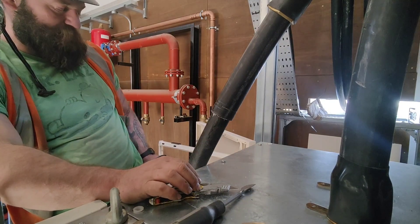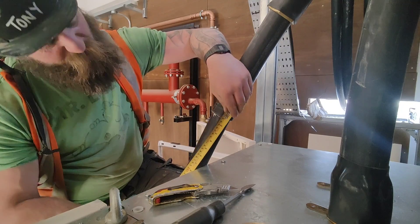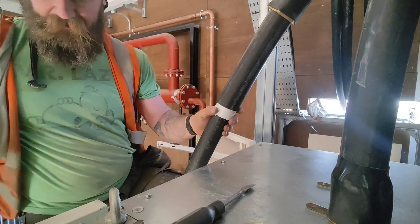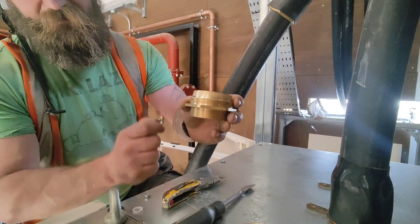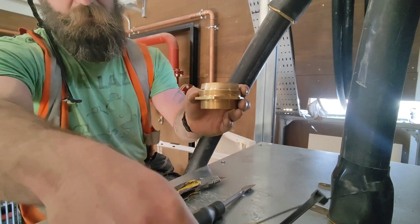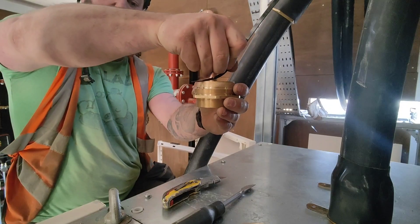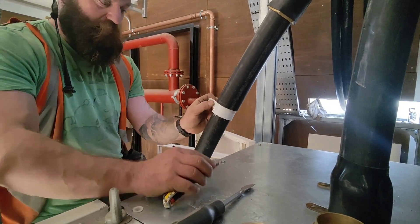That's about 27mm or something like that. I don't think there's a set distance for each gland size — you've just got to sort of judge it. What I do is take that distance and more or less double it, so you know you've got enough for the armour to spread out. It'll spread from the centre and sit there. If it's too short it sits too far out, and if it's too long there's every chance it will come up behind the shroud. So you've got to get a happy medium.